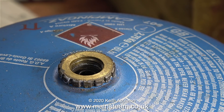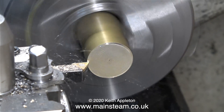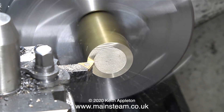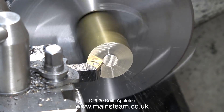So what am I making? This is a camping gas cylinder and this is a camping gas regulator. I'm using a much bigger piece of brass bar because I need it to have a flange on the top which compresses an o-ring to seal the connection. You'll see this later on in the video.